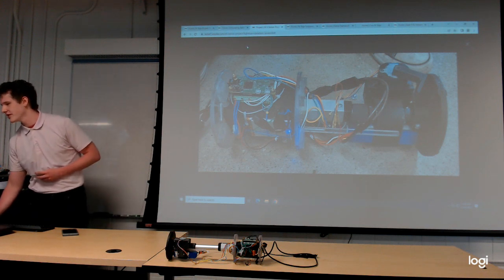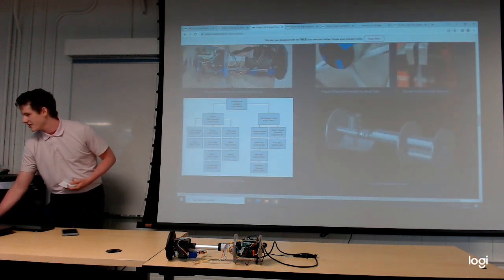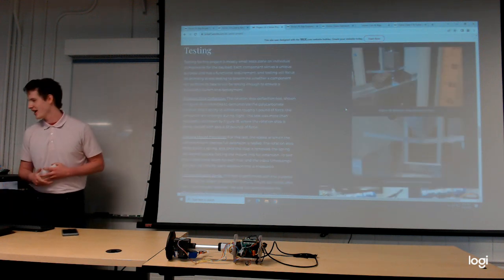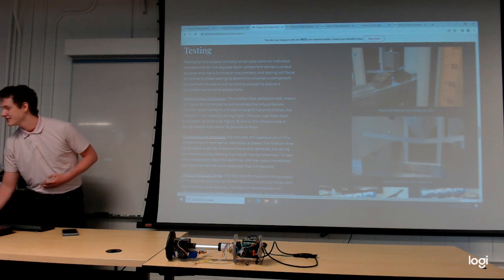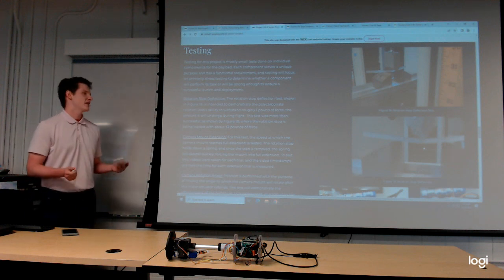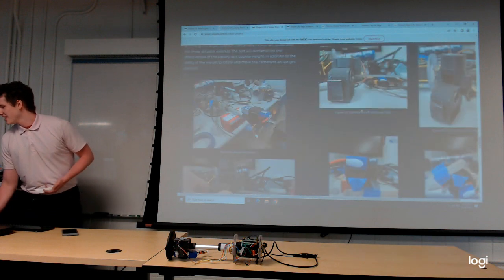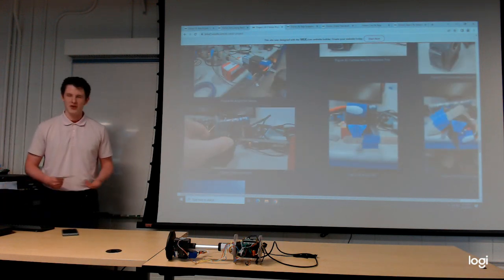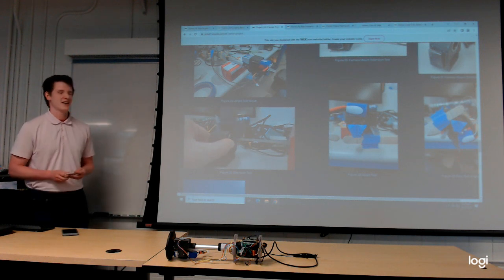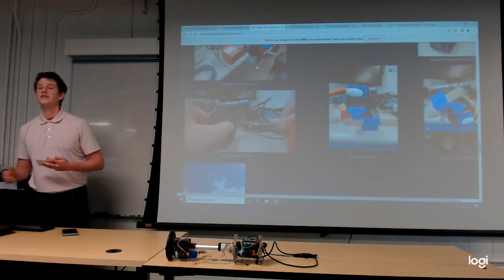Smaller tests were, of course, done on payload components just after the fact. For instance, the rotation stop, as I've talked about before, needed to be able to withstand one pound of force during the flight. I found that it was able to confidently deflect only 0.12 inches under 32 pounds of force, meaning that it's way stronger than it ever would need to be. I also tested things like the rotation angle of the camera, finding that it is never, ever going to rotate fully upright. It's just not going to happen. So, fun thing. Anyway, these component tests were successful.